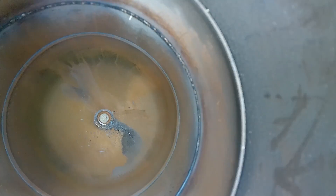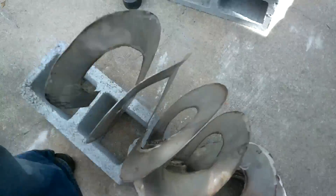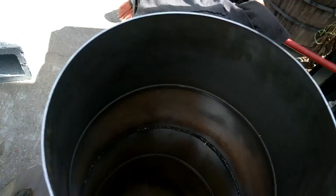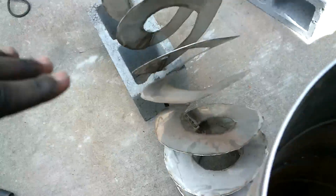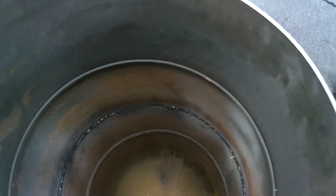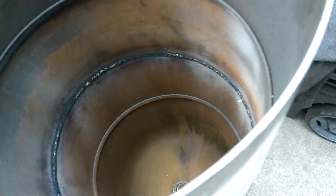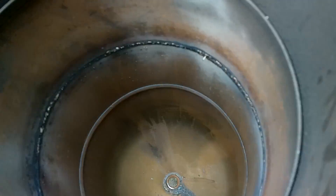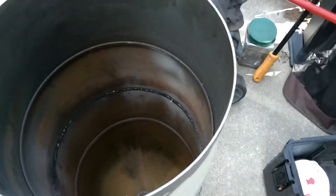I'm assuming it's welded to there and it's just a part of it. The easiest way to deal with this is to just grind these down. It's not that much that needs to be ground down, and that's way easier than trying to remove it any other way — which would probably end up damaging or weakening the weld. This ring is probably more for protecting the weld itself than aesthetics. Regardless, we're just going to have to grind down these rings a little bit. To be fair, it will probably work better that way, because for auger blades you do want a little more clearance than this — there's barely any clearance right now.